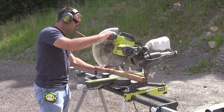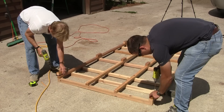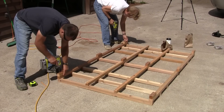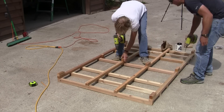We decided to add some 4-inch long spacers to the backside of the trellis to keep it an inch and a half from the siding of the house. This adds some dimension while also giving room to run vines or drip hoses from the backside. Add the optional spacers on the top, bottom, and middle part of the trellis.